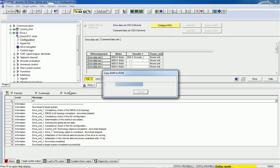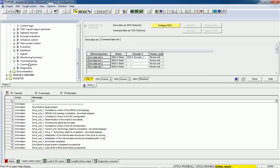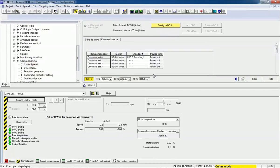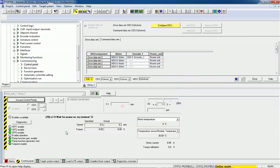Next we will see how we can start the drive from the Starter software. We have the option Commissioning in Starter — we will open this and go to Control Panel. Here you get the control unit option and we can assume control priority. I will click on this button. Monitoring time we can set to 1000 milliseconds so it continuously checks the data, and I will click Accept. I will click on the Enable button so the control panel from Starter is activated.